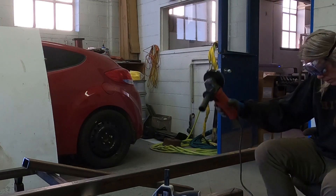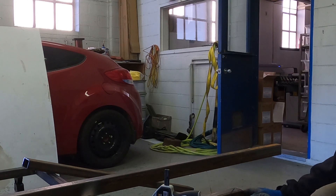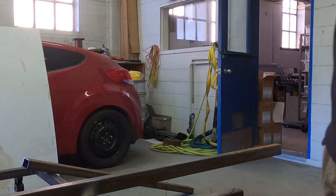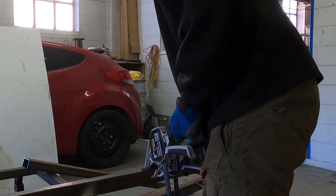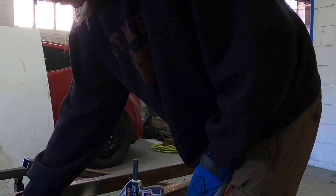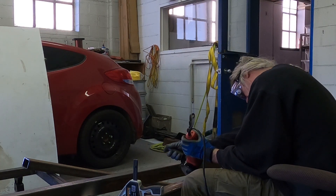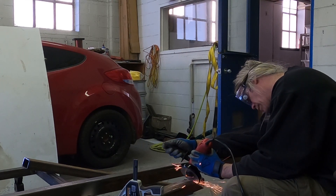Through the magic of video editing, all of a sudden the cross beams are welded to the main frame. At this point I've welded the two-inch by three-inch center beam for the tongue of the trailer onto the main trailer, and now I am doing the obscure cut to match the two support beams, one on each side. It's not a cut that you can use a chop saw for, so you actually have to use an angle grinder and a cutting blade. I'm not even sure what angle the cut is — I basically stacked it on top and used a scribe to draw the general line, and it seemed to work, but it will not fit in the chop saw safely.